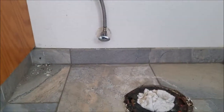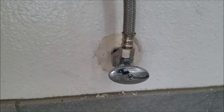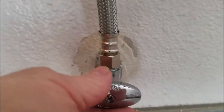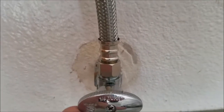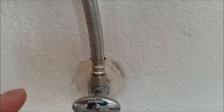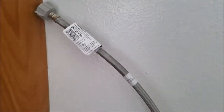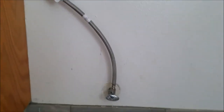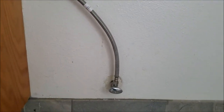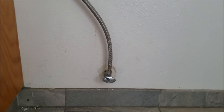We did replace the valve over there — it's a quarter-turn shutoff. I can't operate it because the water's on to the home, but it is quarter-turn on, quarter-turn off. These have stainless steel balls inside — rarely do they leak at all. And then a new supply line — that's the one we had installed previously on the multi-turn valve that we took off. Just put it back on there. So just leave that for right now, and at least the water's not drip-drip-dripping.